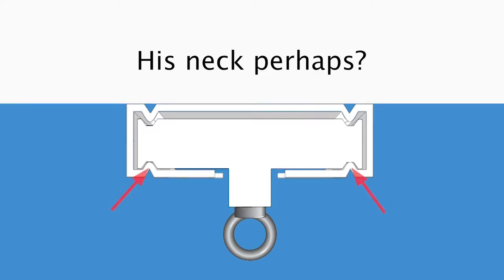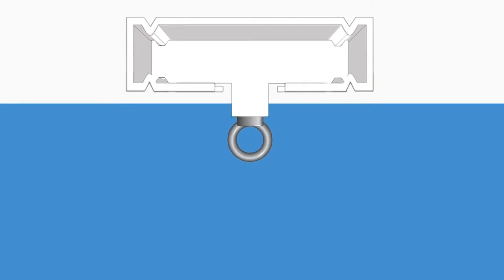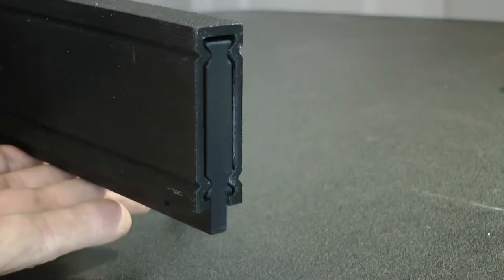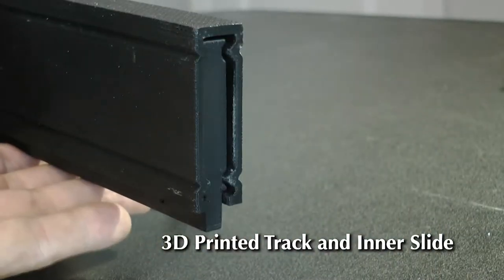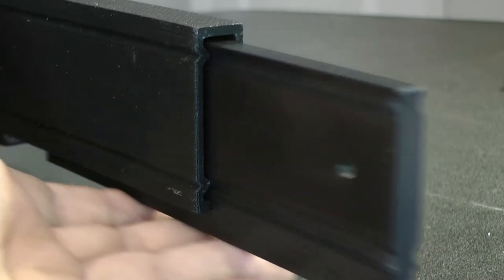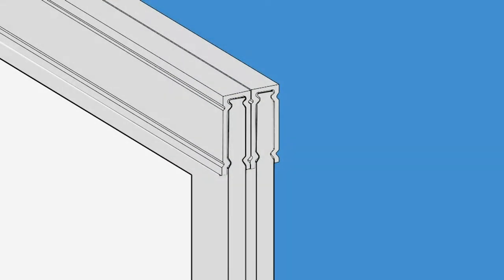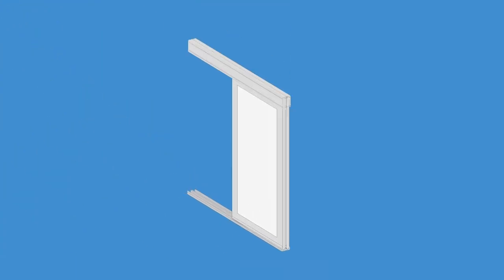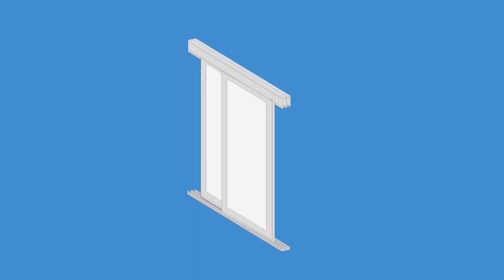The track can be mounted on the ceiling for suspension, with the inner slide riding on the lower two rails. The track can also be mounted in the ceiling and be covered, leaving only the slot for the inner slide mount. With the track mounted in the vertical position, with the opening for the inner slide at the bottom rather than the side, it could be used to suspend sliding doors, especially where moisture could have a detrimental effect, such as showers or outdoor sheds. The quad rail track, a versatile design for replacing ball bearings in a low friction environment.